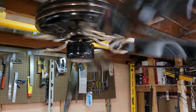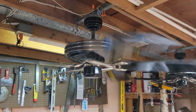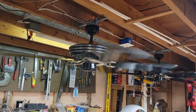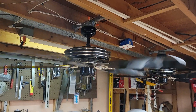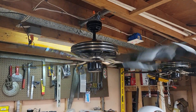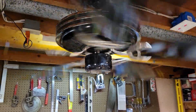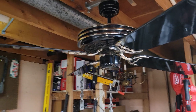The background noise you're hearing is my whole house fan if you're listening on headphones. This fan has a bit of a wobbling issue, probably due to warped blades — the blades are all mixed and matched so of course being weight-balanced blades, if you mix-match them they're out of balance. We're cruising at around 200 RPM. The fan's 13-degree blade pitch throws out a pretty good breeze. We'll start this one up on low.